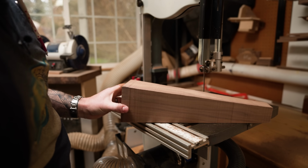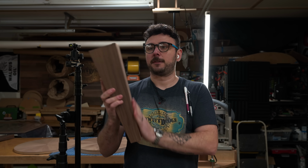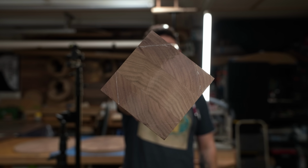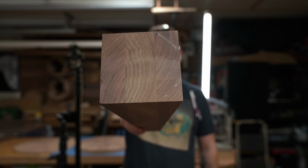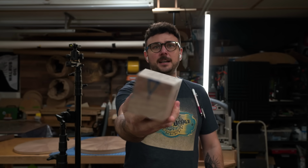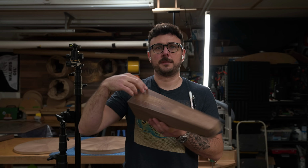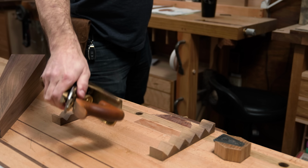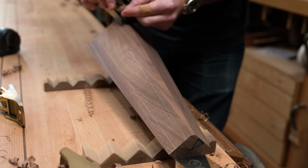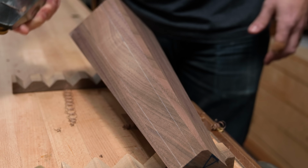I've got the cone, pyramid. Now that I've got the square cone slash pyramid, that'll accept four different legs, but we have eight of those. So what I need to do is turn that into an octagonal pyramid. The issue is the other end is a little bit smaller, which means all of these bevels on the edge taper as well. I could set up a jig for that, but that sounds just sort of complicated. You've got angles on angles on angles, so I'm just gonna do it by hand.